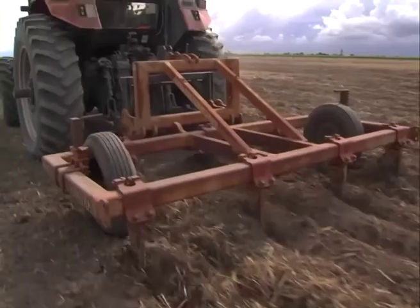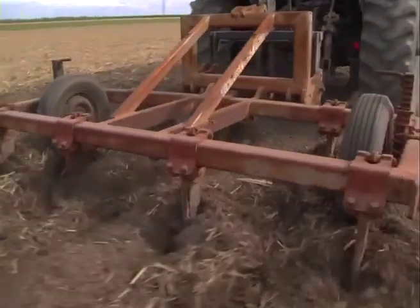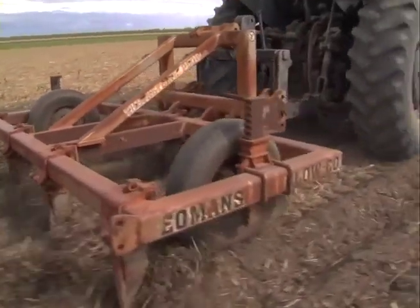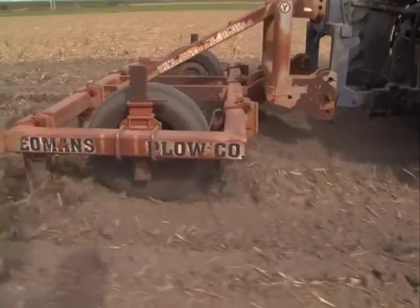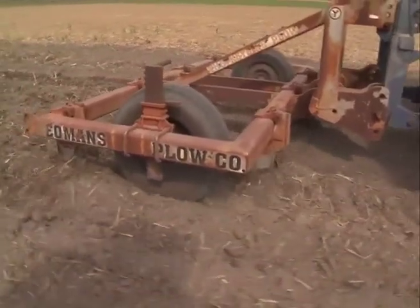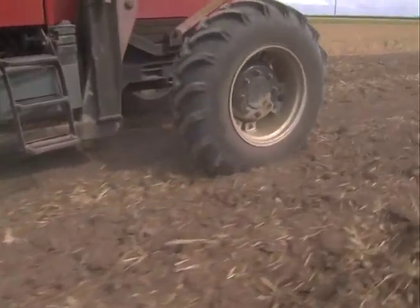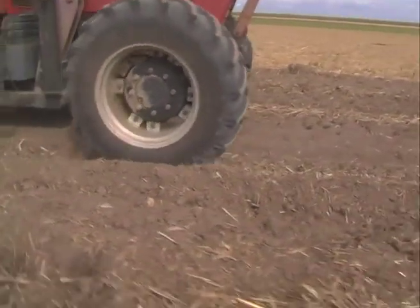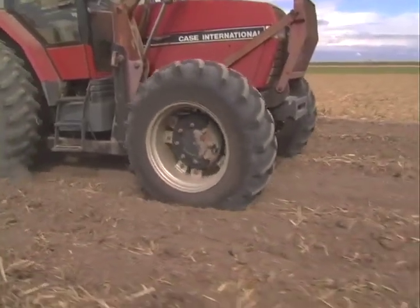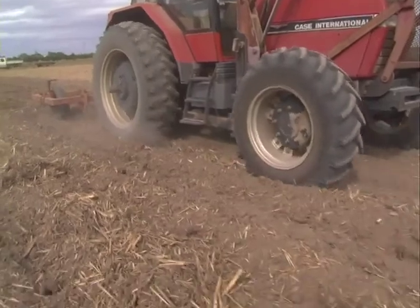Interestingly, of the hundred-plus horsepower on this tractor, 30% of its energy is actually being wasted in rolling resistance — that's the tractor's tyre running over soft ground and then the energy spent relieving the compaction of the ripper tines behind the tyre. At the end of the day it's a gross waste of energy to be cultivating country just to be running over it. That's the philosophy behind controlled traffic — leaving a traffic zone where it's easy for the tractor to work on that nice hard running surface, like where we make bitumen roads.